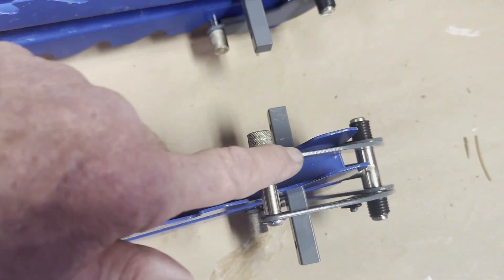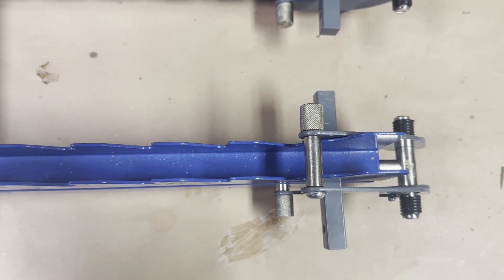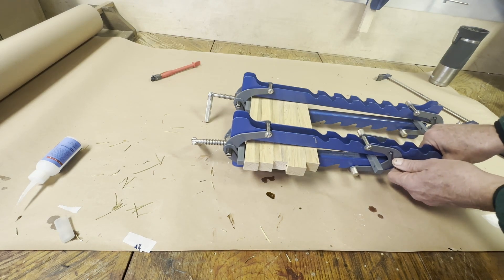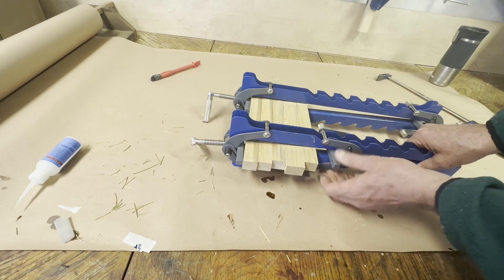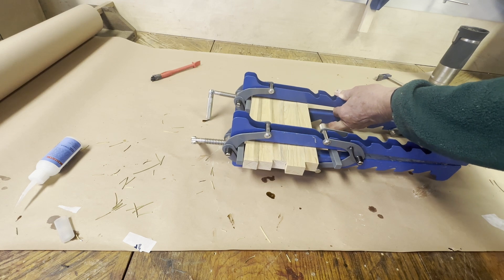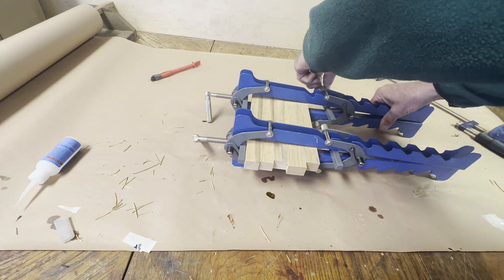This happens a lot when you're inserting the thing and you're trying to hold the mechanism up with the screws — it's easy to insert it the wrong way, so just be on the lookout for that. It obviously has to go in the middle of both of those arms. Once you have those tail mechanisms all lined up on the same slot, it's pretty easy to push them forward as far as they need to go depending on the width of the panel. For this example I had to put them in the last slot — both the top and bottom of that clamping mechanism have to be on the same slot, and the left-hand and right-hand sides need to be symmetrical, all in the same slot. It was pretty easy here because it was just the last slot, but if your panel is wider, it might not be quite so easy to tell if they're in alignment.